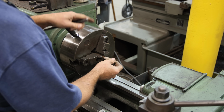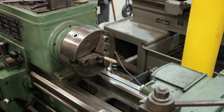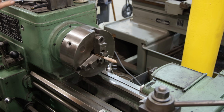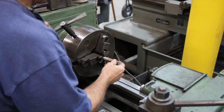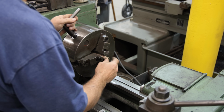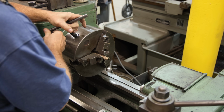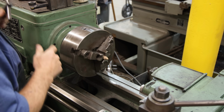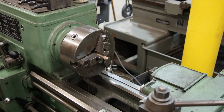As many times as it's been turned and torqued, I'll be willing to bet you that we got some runout there. Let's see. Yeah. All right, we'll just grip it up closer to the bottom. I need to have a little bit of room for the tool to clear. Much better. All right, let me get my compound set to 60 degrees and we'll get that cut out.